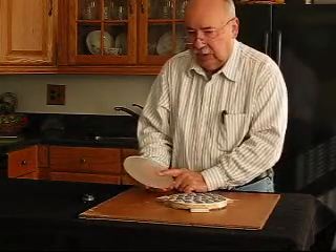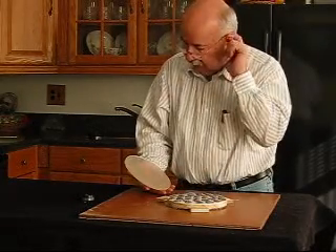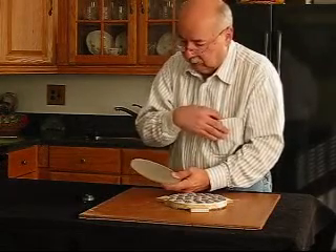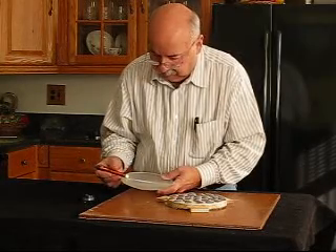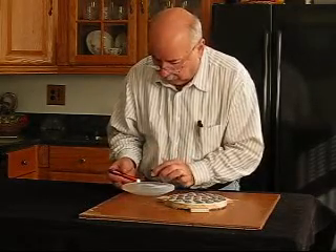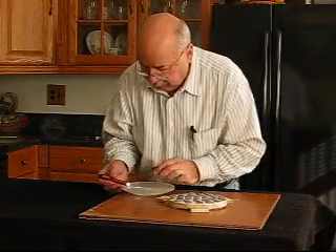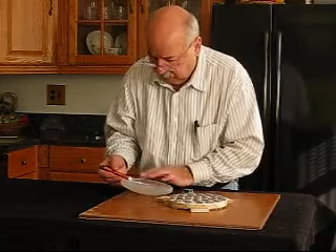My wedge is okay, my radius is okay. So the last question is whether the surface is cleaned up enough to move on. It looks pretty good and nice and even, but unfortunately because I haven't run it long enough there are still a few pits left over. You can't really see them well on video, but with a good high-powered loupe you want to go over every square inch. Anything that glows like a bright star — if you can wipe it away it's dust; if it doesn't move, it's a pit.